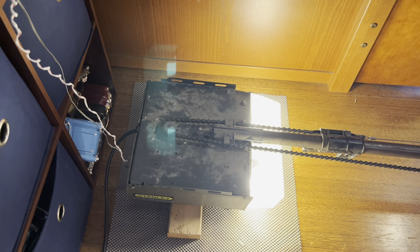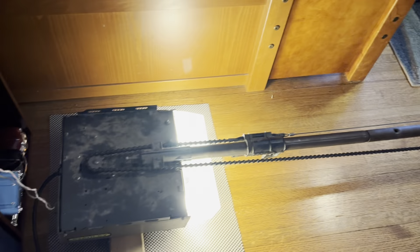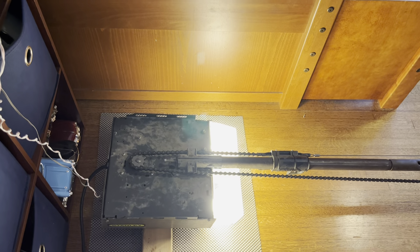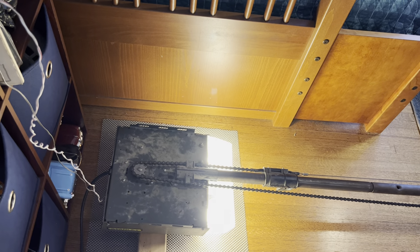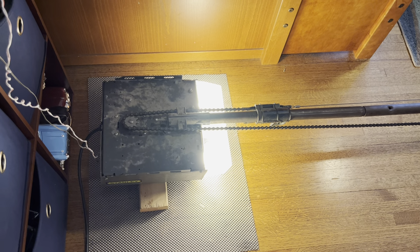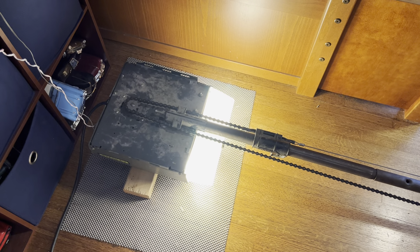So under here you have the white dial and the black dial — those are your open and close limit adjustments. It'll basically tell you on the bottom which way to turn those to get it where you want. Basically, when you would unpack these brand new, you'd put the trolley in the center and then just run the motor until it stopped. How these work is it wouldn't run very far at first, and you would just keep turning it until it's where you want. Because if it's on either the up or down limit and you turn it so it needs to go more, it will come off the limit, and as soon as it comes off the limit it'll actually start running so that it hits the limit — which makes it pretty easy to set. You just keep turning it until it slowly bumps its way up until it's where you need it to be.